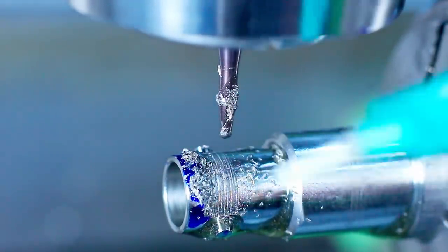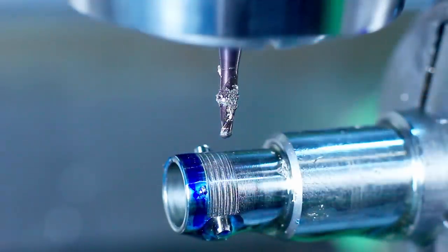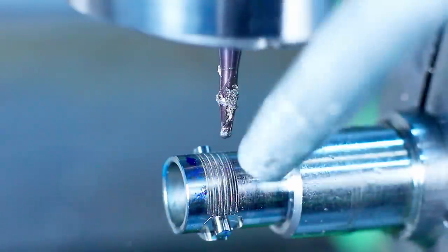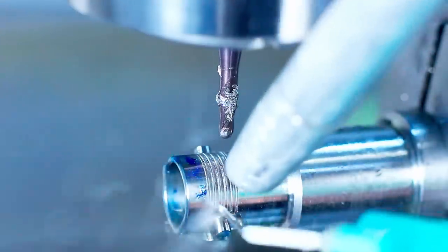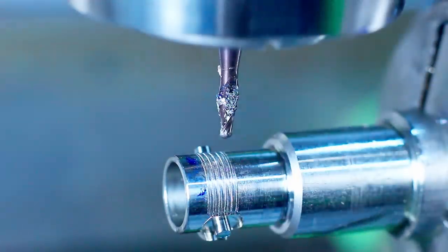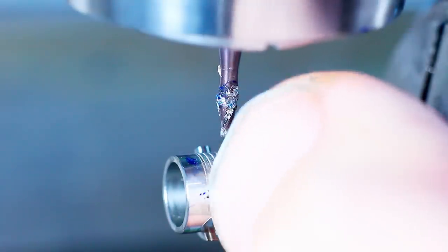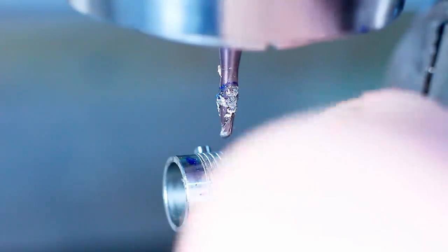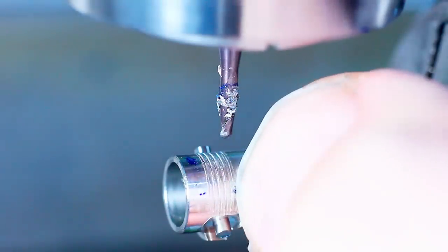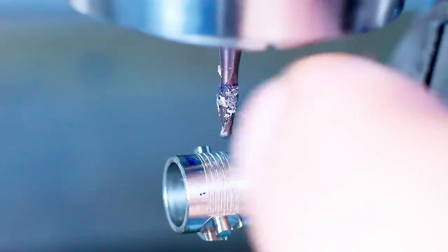Okay, let's wash off the cutting oil. This is just isopropyl alcohol. And now you can see there's a tiny, tiny ripple to the surface, but that's about, I think, about 6 micron height on these cusps. I will do a sketch later how that looks.